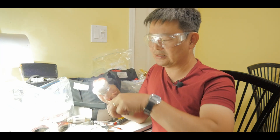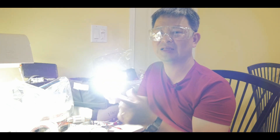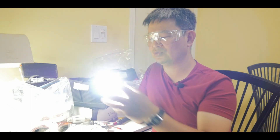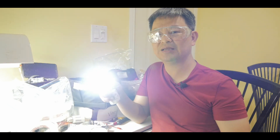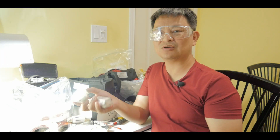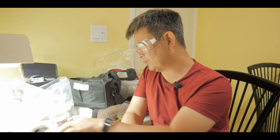Here, let me show you again — this system is so bright, look at that! It gets hot: if I put my hand near the LED light, you might even get burned. So it's important that you have a way to dissipate the heat. This particular LED light bulb actually has a metal casing, so all the heat is dissipated along the metal grooves. So 11.1 volt lithium battery powering this broken LED light bulb is very useful — look at how small it is. I can carry it in my hand like this, and there we go — a very powerful LED flashlight.